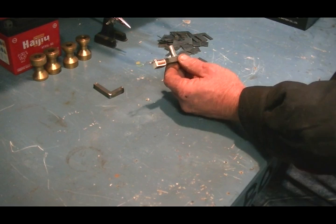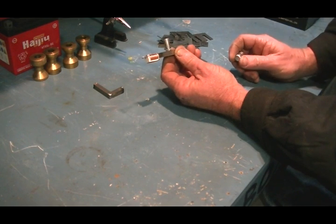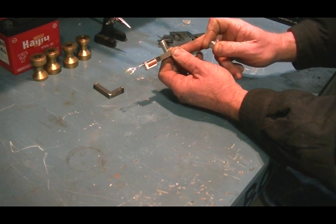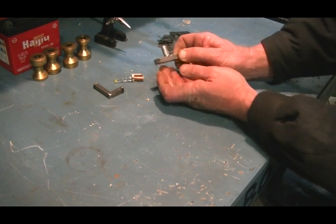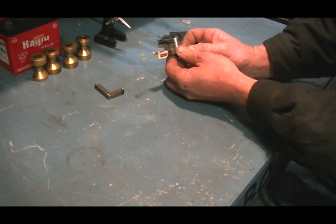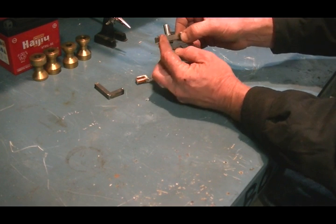Well, the way you do that is you get another magnet and make sure it's opposing the top, so that will be two north or south fields there. Our north is on the bottom, and so what we're going to do now is put a south field at this end of the core. As you'll see, the magnetic field disappears from the coil. What happens is: as it is at the moment, the field is coming out and going into the coil. When we put the opposite polarity on this end, the field changes and goes in this direction, and the field disappears from here.